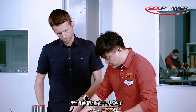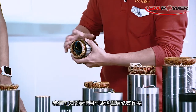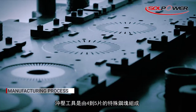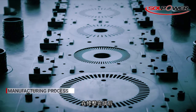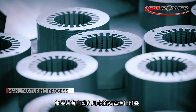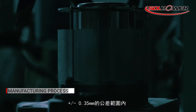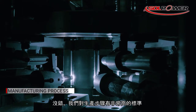After the numerical simulations, we can finalize the stator and rotor design. The next step is the stator-lamination stamping tool. The stamping tool is composed of four to five pieces of specific steel blocks by grinding and cutting. After the tooling is finished, we start the punching process. During this process, each stacking is stacked automatically and concentrically. We use 2D measuring equipment to make sure that the total height of each stacking is within a tolerance of plus or minus 0.35 millimeters — very precise, with very high quality control of each manufacturing process.